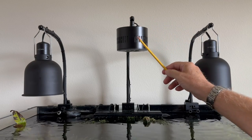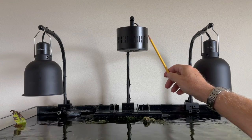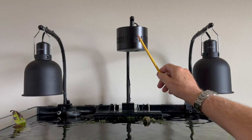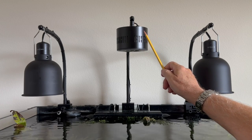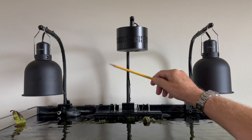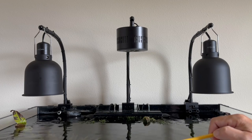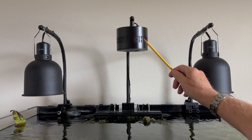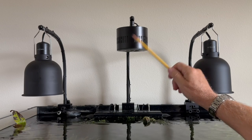To bring you up to date on these Kessil lights, this is the ASTA 120. They now cost about $107 to $137 a piece. I opened up the two that went bad on me. Basically what it is, you have 60 watts and 20 LEDs — that would be 3 watts an LED. I went on the COB and looked at the LEDs. I put a voltage of about 2.8 volts and checked out the LED, and what it is — the LED is out. Once the LED is out, it does not work. So the circuit board was good, everything was good. On both of these that went out, one of the LEDs went out.